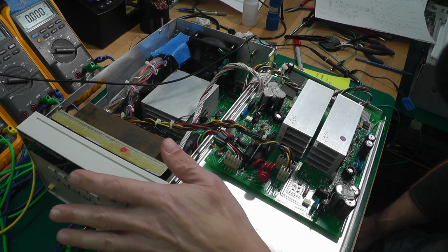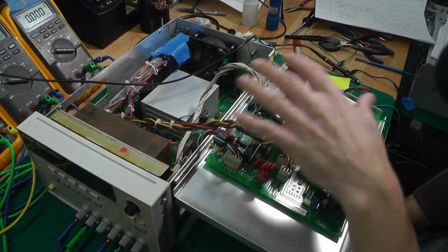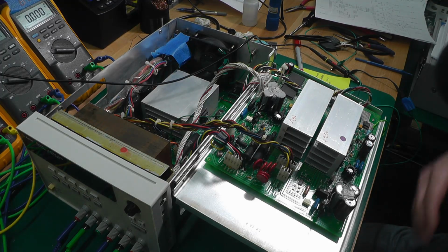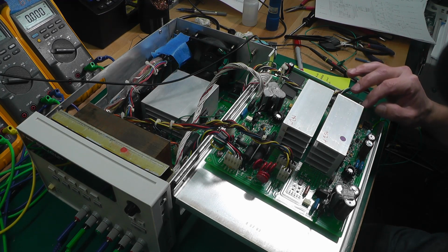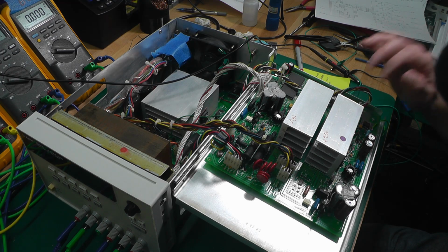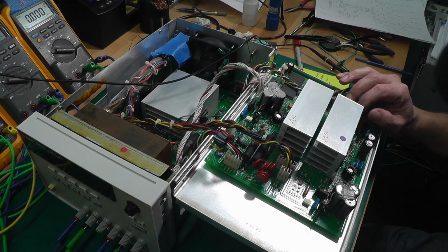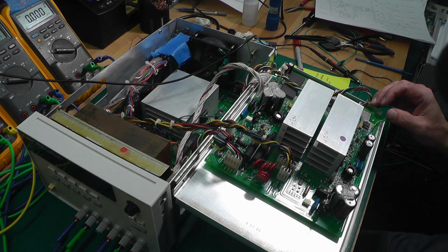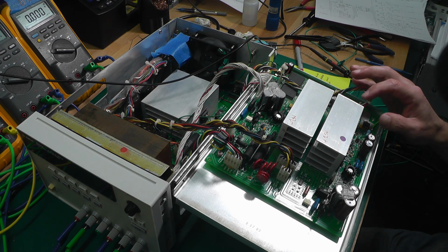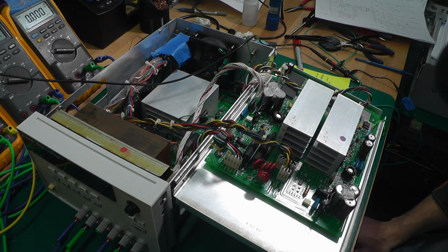So a recap, I've rebuilt the front end, I've cleaned out the power supply, cleaned the PCBs, etc. I've found some components on the processor board, some dodgy resistors, changed them out. 2 op amps that were dodgy, replaced them with like for like, and we've still got more or less exactly the same symptoms. So in the next video I think I'll concentrate a bit more again on the ADC and perhaps the DAC as well, the digital to analog converter, and see where we can go from there.